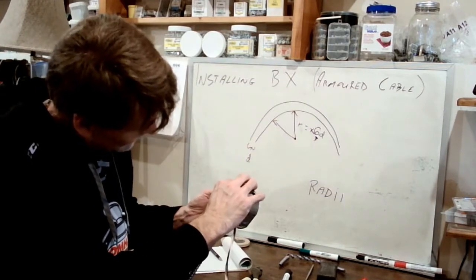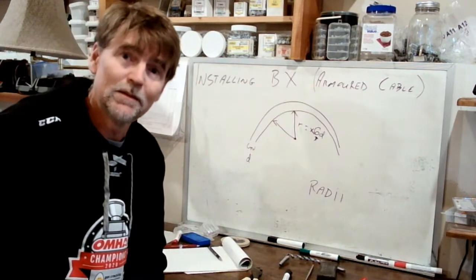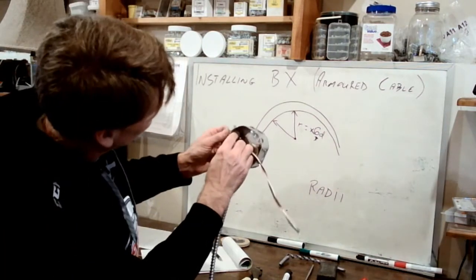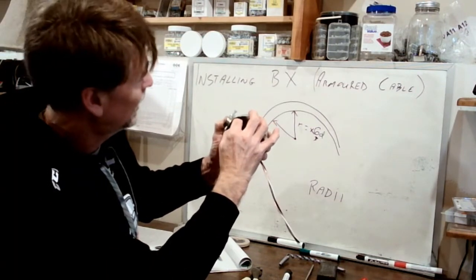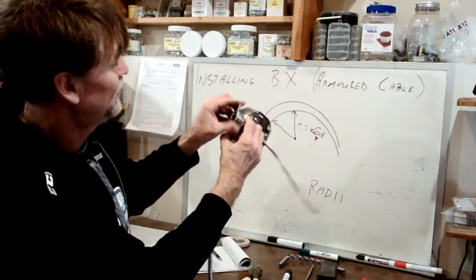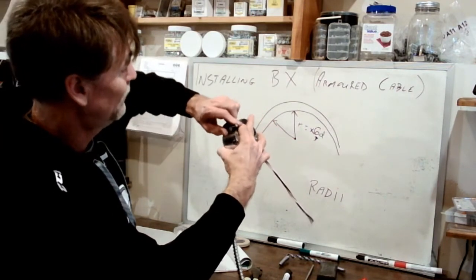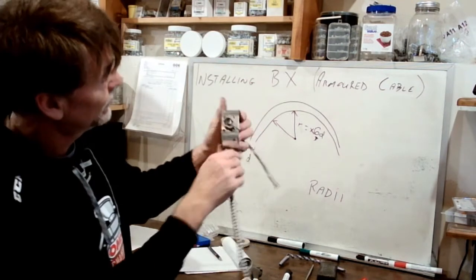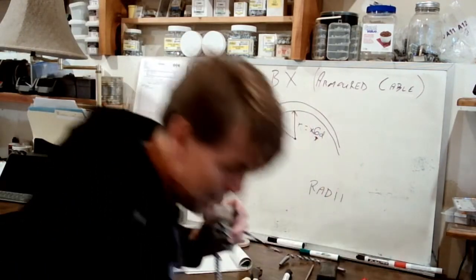Oh, no, I think I did get it cross-threaded. Again, doing this floating in midair is a little bit of a chore. There we go. Now it's not cross-threaded. So what I'm going to do is tighten it as much as I can with my fingers. Okay, and then I intentionally left this so it's kind of off to the side. I'll hold the lock nut in place and finish tightening it by spinning this one forward. Okay, probably I don't want it like that. I'm going to try to get it a little bit further. Just like that is good. Okay, and then I can put my wire inside there.